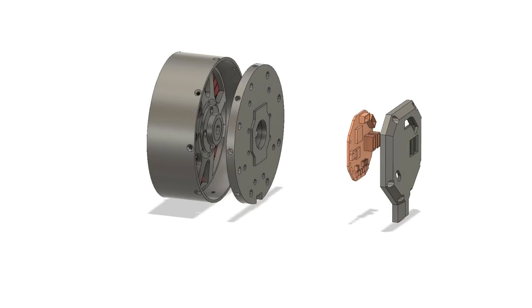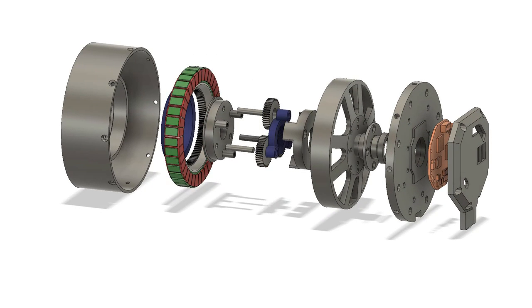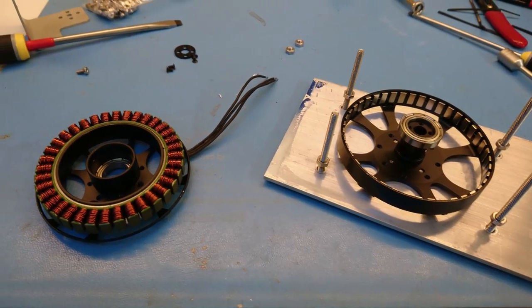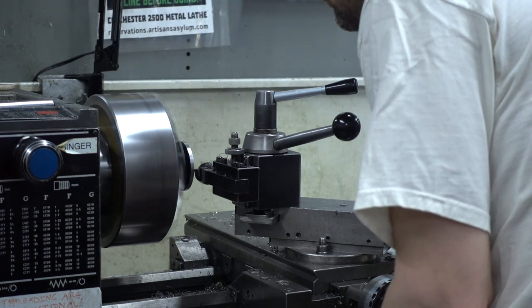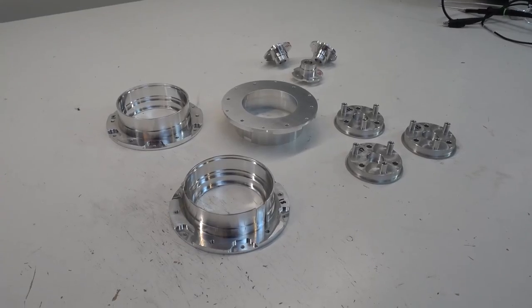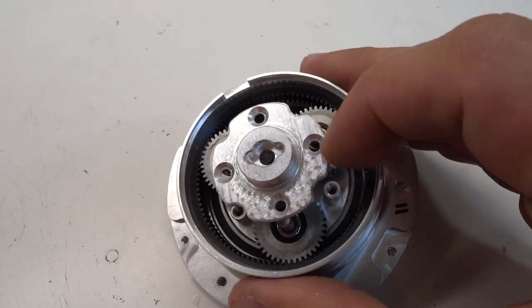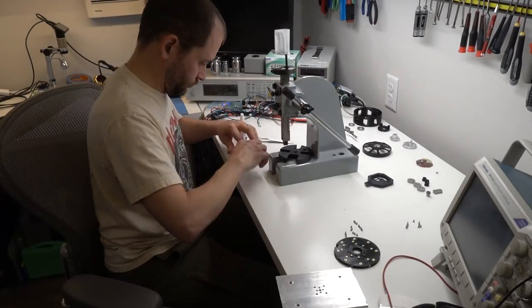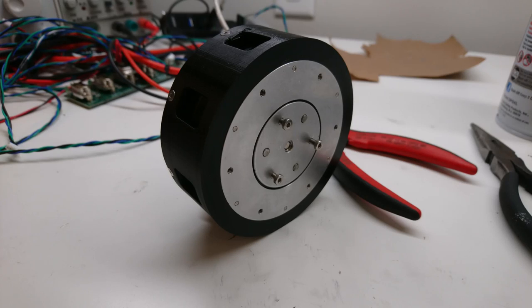Then, when Mini Cheetah was announced, I decided to shamelessly copy the idea of putting the planetary gear set inside the stator, making a first attempt with a 3D printed assembly combined with post-machined off-the-shelf 8108 brushless quadcopter motors. Then I moved to have some components CNC machined from aluminum, while others remain 3D printed. The resulting servo has a 6x gear reduction and weighs about 410 grams overall.